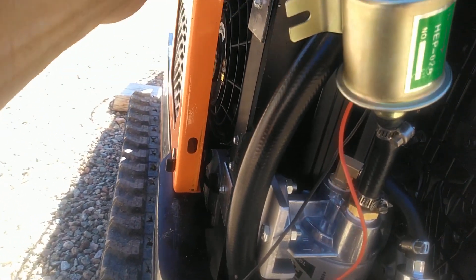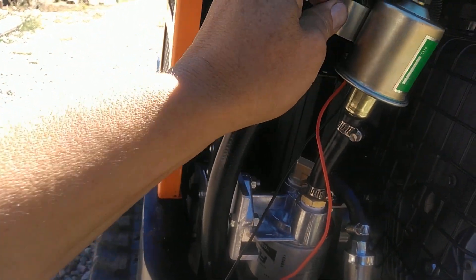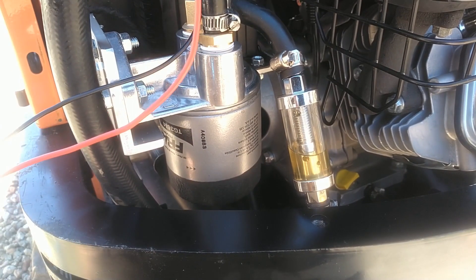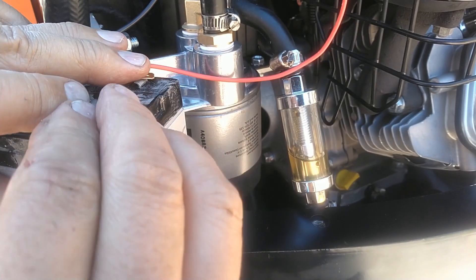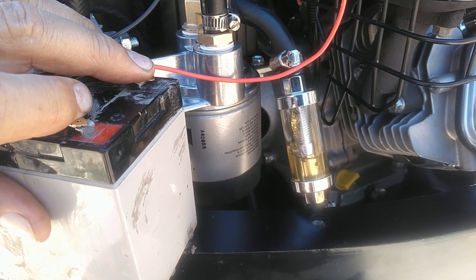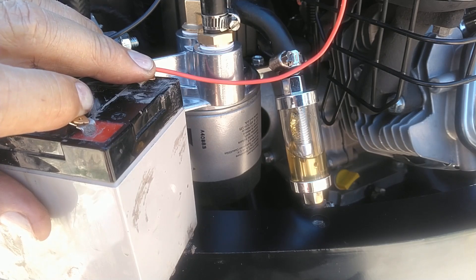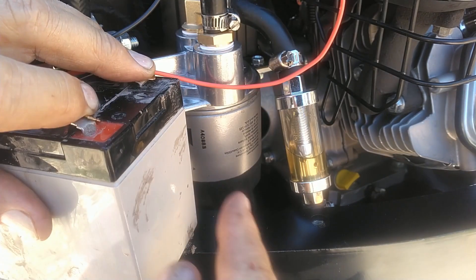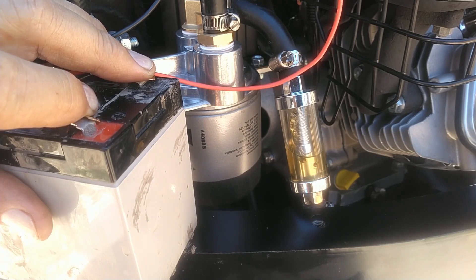I installed the electric fuel pump in place of where the T was for the air gap. I'll zip tie it in place and possibly build a mount bracket. I'm just testing it with a little 12-volt battery for now — it does pump quite a bit of oil, actually more than I expected. Watch the sight glass — once it starts pumping you can see it moving oil through. I'm going to make a mount bracket for the pump, finish wiring it up, and then do a full test with a high-temperature engine run to see how much cooling we're getting.